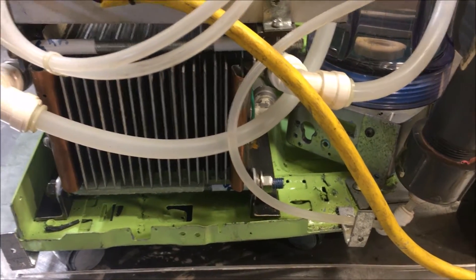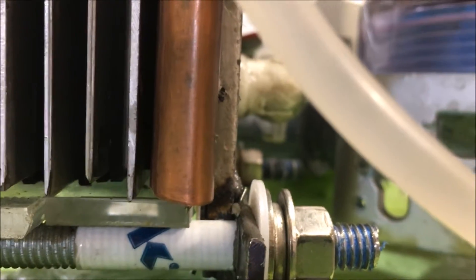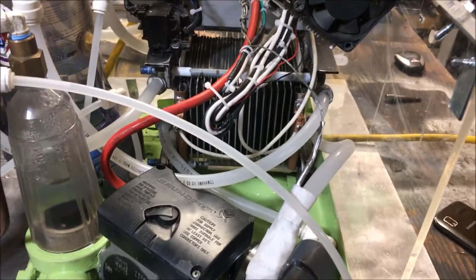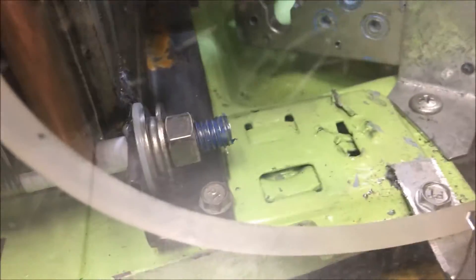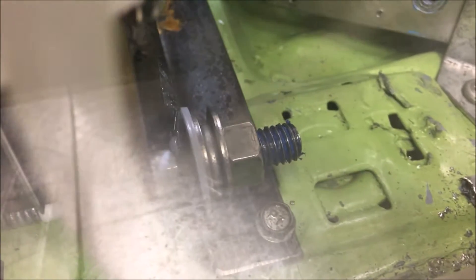I did glue that side. It looks like I've got the room to tighten this thing up a little bit. Luckily, I didn't finish the job completely because then I would have really been screwed. I might be able to get away with just removing the side panel — I should be able to access those bolts. These bolts on the face just have to be held in place, and the ones we want to turn are the nuts themselves. We don't want to turn the welded ones because we don't want to be spinning that dielectric or scarring it up to contact metal. I have to disconnect the anchor points of the cell on one side so that I can tighten this baby up.